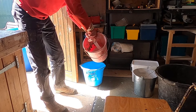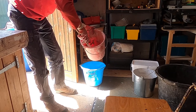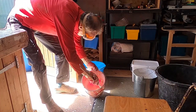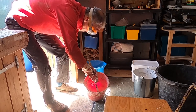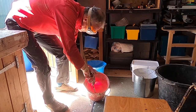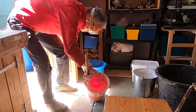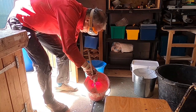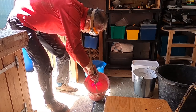Just by way of a little disclaimer: please be aware that everything I'm doing here is based on my own reading and understanding of working with lime. Please do your due diligence and check for yourselves how to go about this process. While I'm doing this, I've pre-wetted the wall with a sprayer in an effort to reduce suction — if you apply this to a dry wall surface it cracks up really quickly. So I've sprayed the wall with water and I'll give it another go when I go around there and start brushing this in.